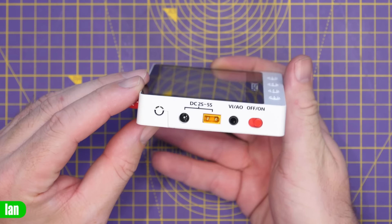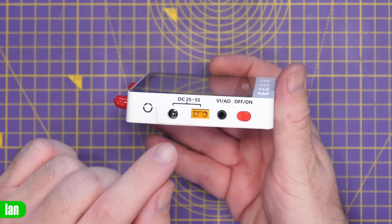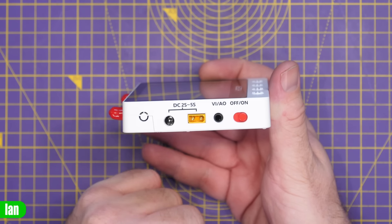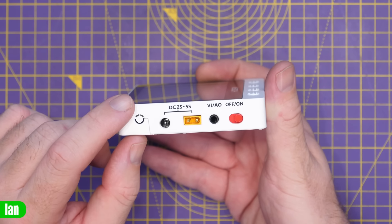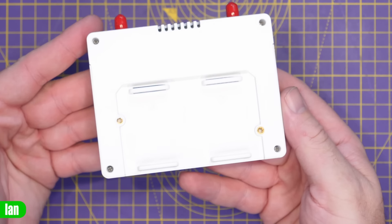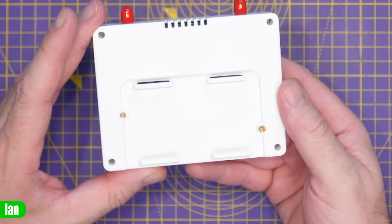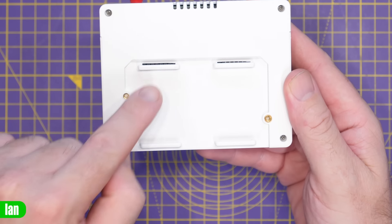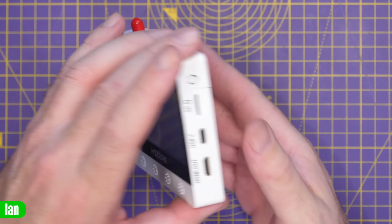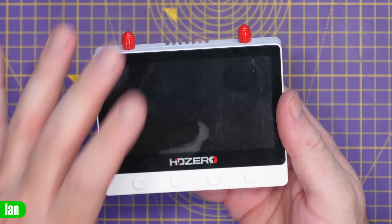Alongside the micro SD card and HDMI output, there's a USB-C port for configuration, and on this side a dual DC input — a DC jack as well as an XT30 supporting 2–5S — plus a 3.5mm CVBS analog video input and a physical power switch. Around the rear there are various mounting options: two threaded post inserts, hoops for the straps, and there will be open-source CAD files available for 3D printing your own mounts and accessories.